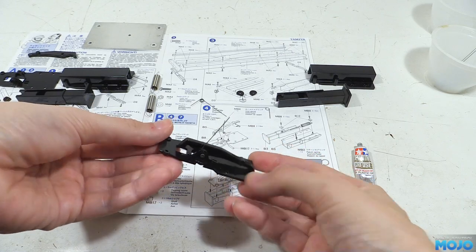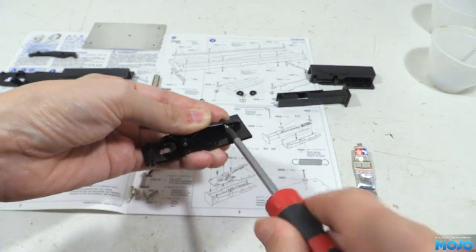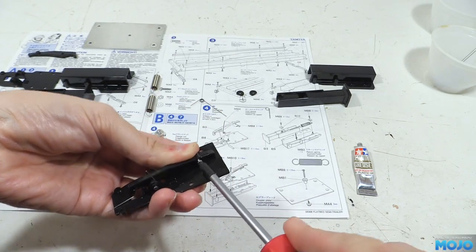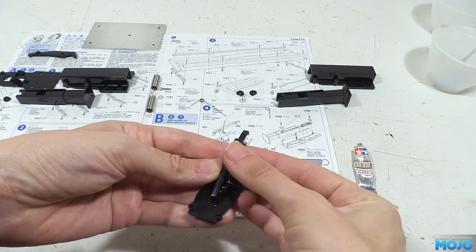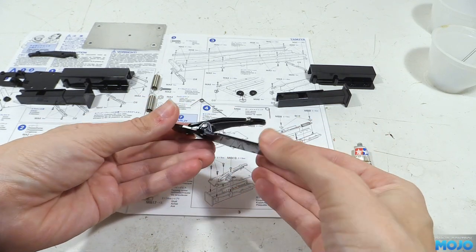So the spring has something to hook onto, we need to thread in a 2x8 near the end of the long part of the latch. We don't want to screw it in all the way — the idea is the spring can hook under the screw head, so we need to leave about half a millimetre or so as a gap. Now we can hook the spring in and we should have a nice working latch, or at least the lever, as there's nothing for it to latch into just yet.